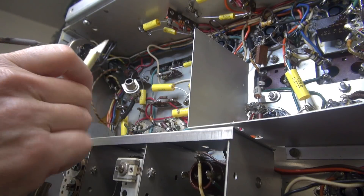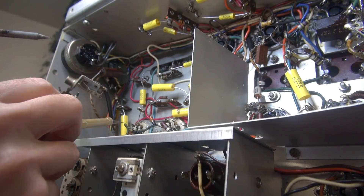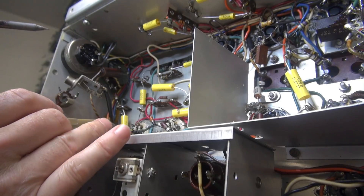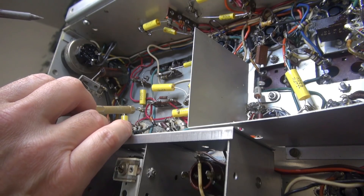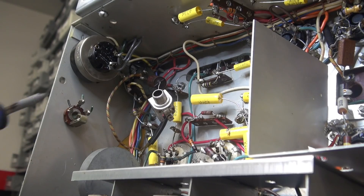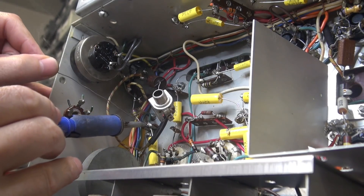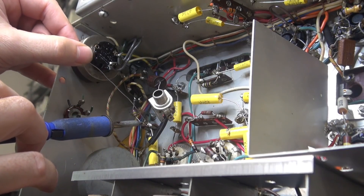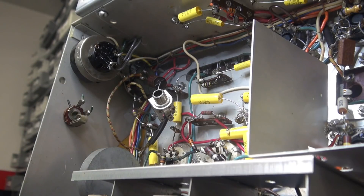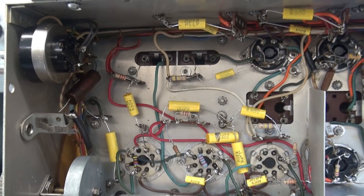This process takes a while, but you've got to be very careful when you get down on these tube sockets — they're kind of brittle and they can break, then you're hosed. A lot of times I recommend you cut the lead, put a J hook in, and hook in your new resistor to save the stress on the tube pins. There's our first new resistor in place — this was the 270K, it was up around 330K. This is a nice new 5% metal film type — lasts the life of this radio.